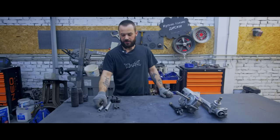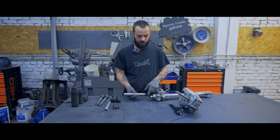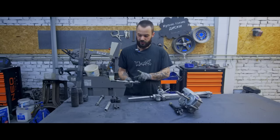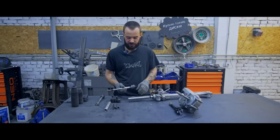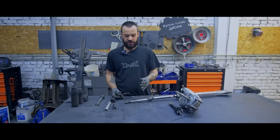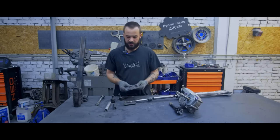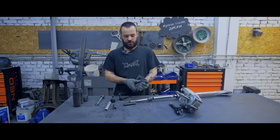We also ordered these steering rod extension pieces from a machinist, for the rod of the steering rack itself, to transfer the axis of the steering rod balls to the axis of both levers, to avoid parasitic oscillations in the suspension. We're gonna use the standard steering rod ends from MIDI to connect them to the steering links. We ordered these transfer sleeves. These dust caps are temporary. We also made a crude set of mounts into the body. We're gonna adjust it more accurately when it's installed.